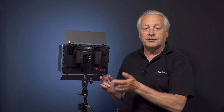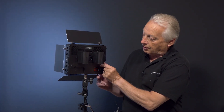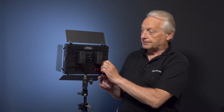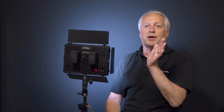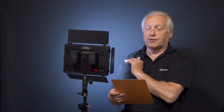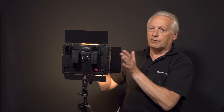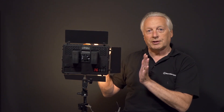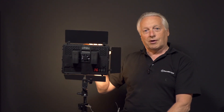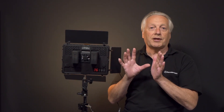To turn the unit on, press and hold the button for about two seconds and the light comes on at the previously set intensity. Using the knob you can control the power from a minimum of 10 up to a maximum of 99 in stepless control. The light appears blue because my studio lighting is tungsten and the camera white balance is set to tungsten. You are provided with a CTO orange gel to bring the light down to tungsten requirements — slipping that in front of the unit, it appears slightly warmer than my studio lights at 3200, more like 2800, which is the normal household bulb rather than tungsten halogen.